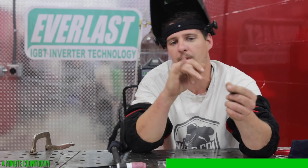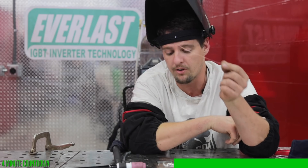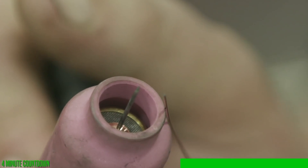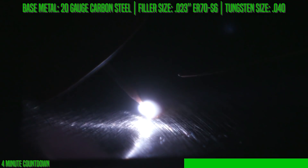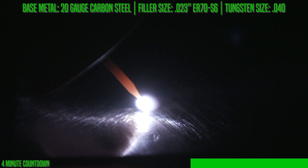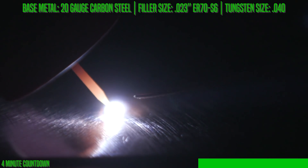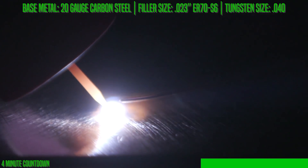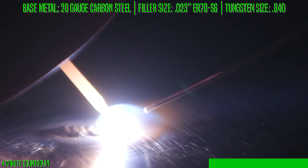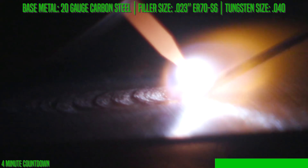Drop down in filler wire. I put a mic on this — it measures 19 thousandths but on the spool it says 023, so we are smaller than the base metal, which is good. Also, I'm running 040 tungsten — you could do 020 tungsten. So let's jump on this base metal. I'm barely pressing the pedal, making sure I'm not giving it too much amps and melting through the base metal. We're going to slowly increase our amps until we start seeing the puddle, then add filler wire and carry it down. See the big difference here — we're not having a massive puddle. We're controlling the heat, controlling our technique, and we're getting ripple effects. It's more defined.